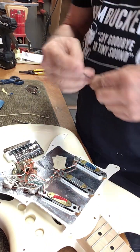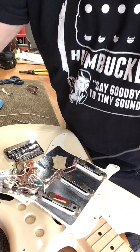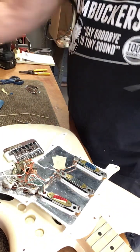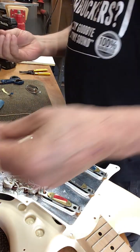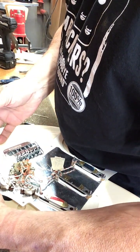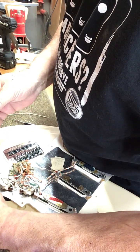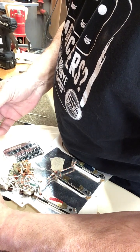The back of tone pots can be hard to solder. What I solder my tone pots at is about 340 degrees. And right now I'm going to put the ground for the output on the tone pot. It's usually that four-second rule, maybe a little bit more.